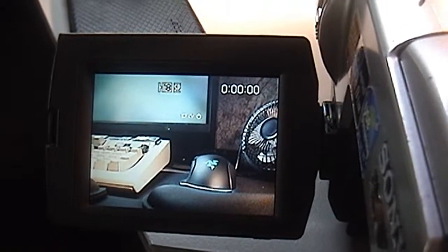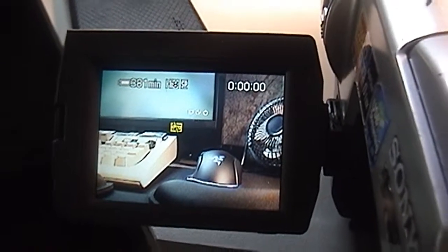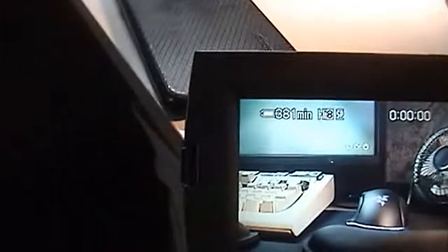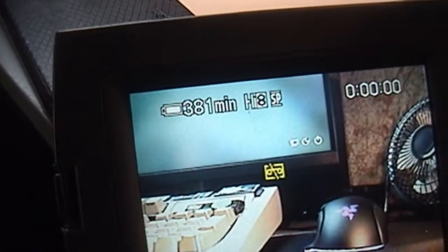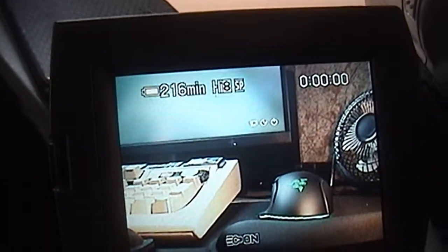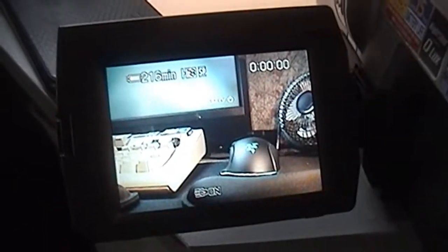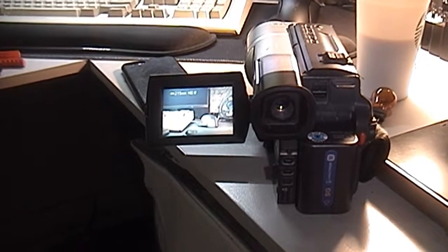Here's another one reporting seven hours and two minutes of battery life — that's not happening. I'll connect it to this camcorder. I'm not a psychic, but I can see within the next minute it's going to start complaining of a low battery and the low voltage cutoff will kick in. See, it says 381 minutes — turn on that halogen spotlight and wait. It's probably going to behave now on camera, because that's just the way these things go. But I can assure you when I put it in to record this video, once the tape mechanism started it just began complaining it was going dead.